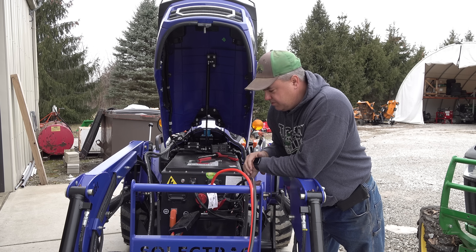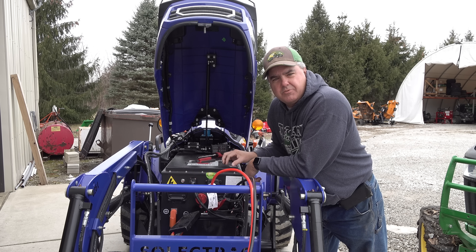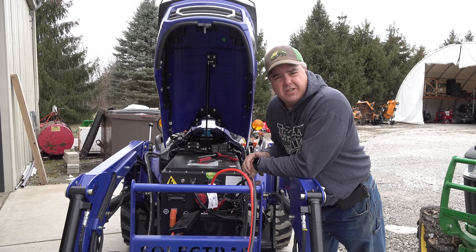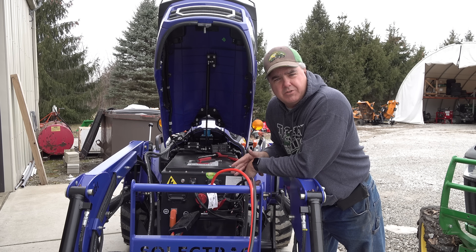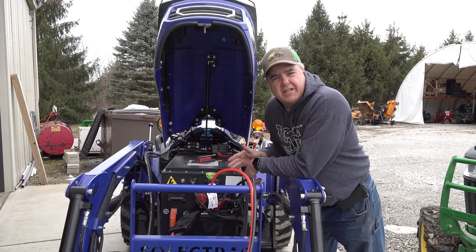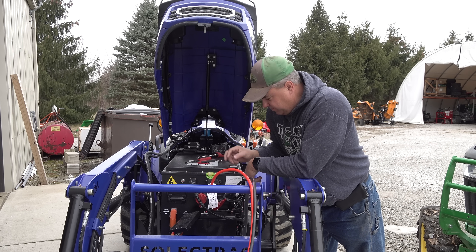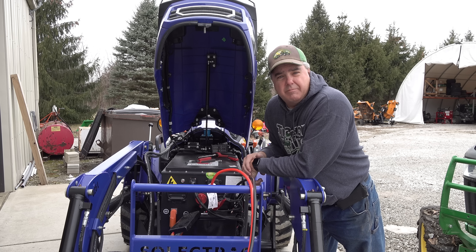What's interesting is that the large battery is not capable of giving a quick charge to the 12-volt battery. That's why I'm still hooked up here to the 3046R. It will maintain the battery, the support team told me, but it won't really charge it. You can kind of tell how that would be the case here because it's got very small cables and very small connectors or terminals on the battery. So it's not going to charge or discharge it very fast from the tractor.